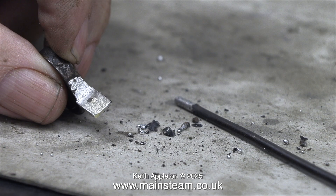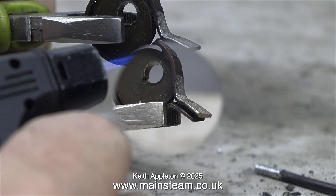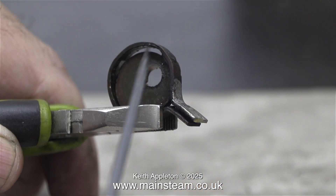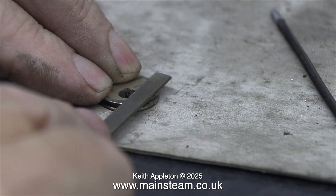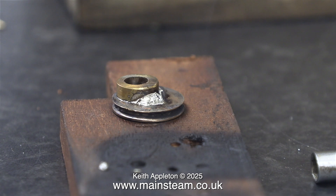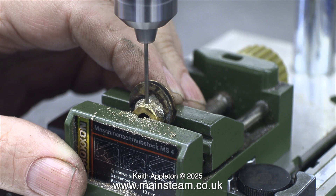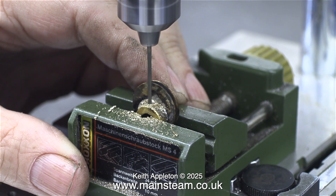The first thing I'm going to do is clean off all the solder and get it back to something at least like bare metal. Once I'd removed all the solder, I heated the eccentric strap and then levered it apart with a screwdriver. It's a very strange construction and it was held in place to the crankshaft with a very small steel wedge tapped against the crankshaft in an area that had been filed flat. I didn't want to fit this small wedge — it didn't allow for much adjustment. So what I'm doing here is cleaning the face of the eccentric sheave using a needle file to take it back to bare metal. In my scrap box I found a piece of phosphor bronze where the hole wasn't in the middle — it was perfect for the job, so I parted off a piece and soldered it to the eccentric. I brushed away the excess solder before drilling another 1/16th of an inch diameter hole to allow me to thread it 6BA for a 6BA machine screw, which will allow adjustment of the eccentric relative to the valve position.